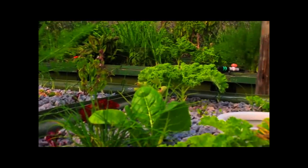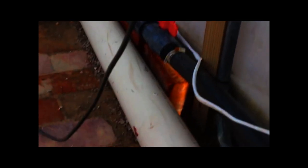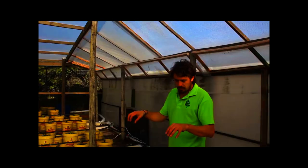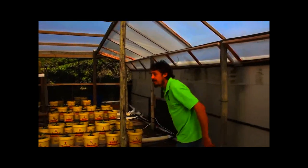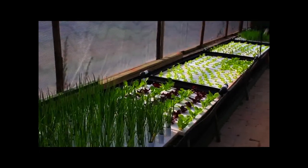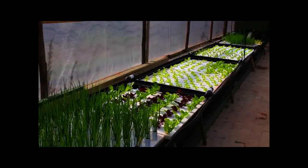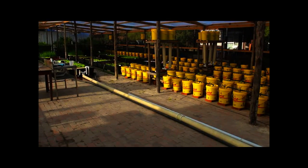All right. From the fish, a small pump, 350 watts, I think, will come up out of here. It'll split into a system, and these are our drive lines. Okay, we call them our drive lines. So outside from the fish, all of that nitrate dense and nutrient dense water is being pumped right up into our growing area. And the rest we work on gravity, because remember, we're trying to operate at a level where the energy requirements for the system are at a minimum.